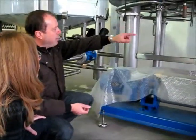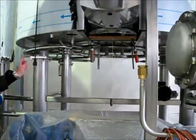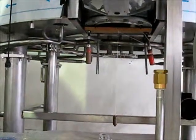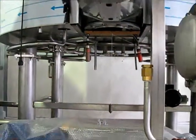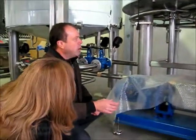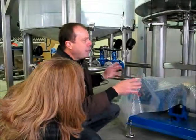You see the lauter rings — you see the suction side of the pump goes up and connects to this ring. We have evenly distributed outlets on this ring to collect from each square meter, or each square inch, of the Lauter Tun. We try to collect evenly, so that means we have an even washout.